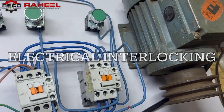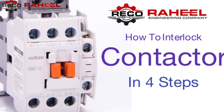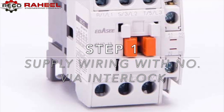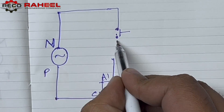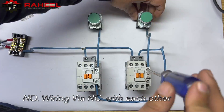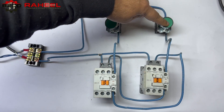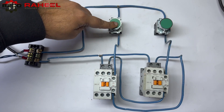The second type is electrical interlocking. We will cover it in four steps. Step one is supply wiring with NO (normally open) via interlock. First we make the wiring diagram, then execute it. We do supply wiring with the NO push button and with NC points of each other's contactor. We test the wiring — it's working. You can see the interlocking wiring result.